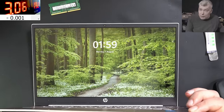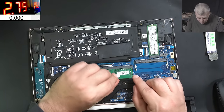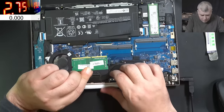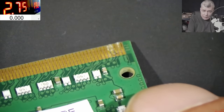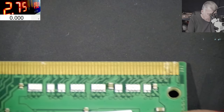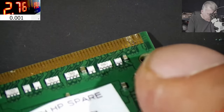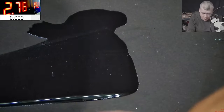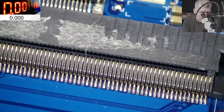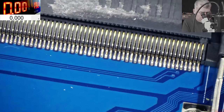Let me shut it down and try again with the original RAM memory. The laptop is off. Let's plug back this RAM memory. Wait - let's check together. Here is some sign of liquid damage. You can see that white mark - that's kind of like liquid damage. But it's only there. The liquid damage was here on the top of the socket. We're not going to use this socket anyway, so let's clean it.